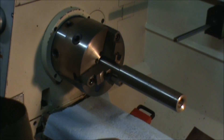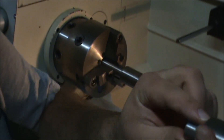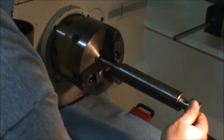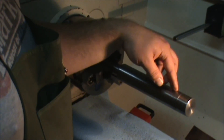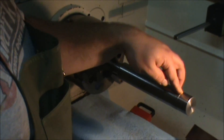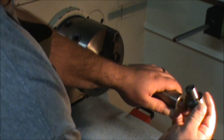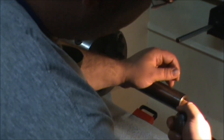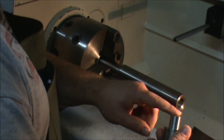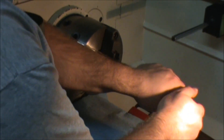That's a good fit - you can hear the suction on there. I'll mill a flat on top of this piece right here, just a small one that I can line up with the set screws I'll put in here. They'll come down and engage the flat so that you can't twist or turn, and they'll hold it in there. Feels like I've got to clean up something in that hole - yeah, there's a little burr in there. I'll probably just take some off the back of this and shorten it, but I'll put my set screws and they'll engage that.